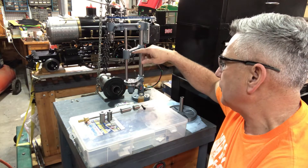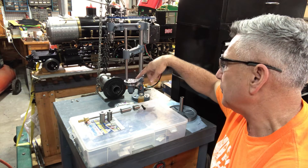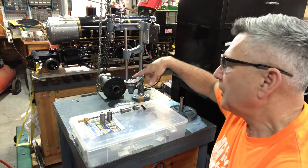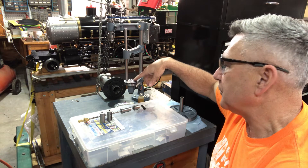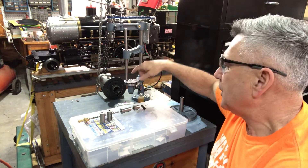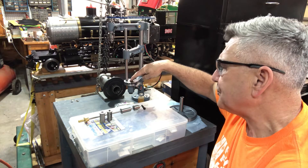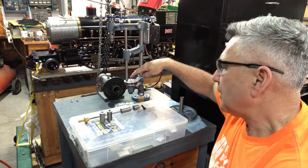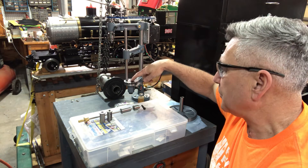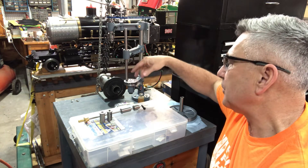What I wanted to concentrate on in today's video is the alternate style rotating stake plate that I made for the pillar tool. After studying both the description in the book and the description in the Home Shop Machinist magazine, I decided to make the alternative style because it took the slop out of it. The book has a larger centering hole for the centering bolt, likely because of the pin, while the magazine article omitted the use of the locking pin on the bolt.